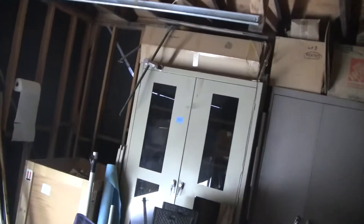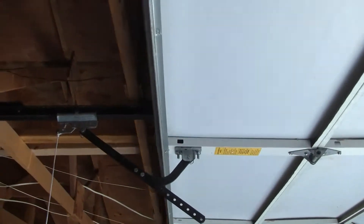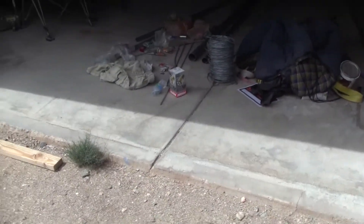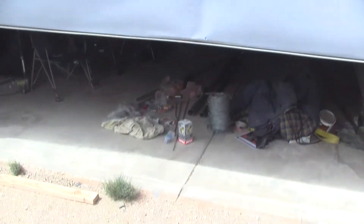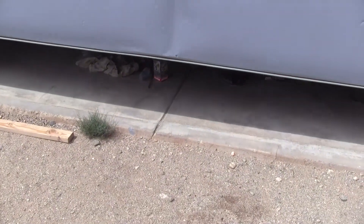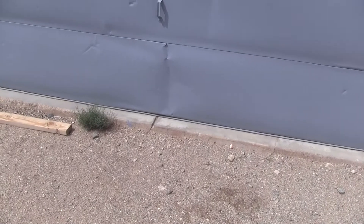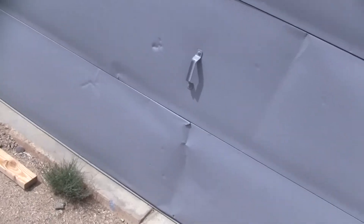So it's perfect — well, okay, it's not perfect, but it's a whole lot better than it was. I could tighten the spring a little bit more to make the garage more neutral, but it works really, really well. Let me show you on the way down here. Here comes the door, and usually right about there it would reverse. Now it goes all the way down.